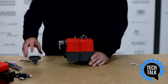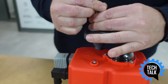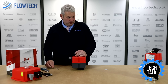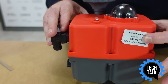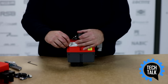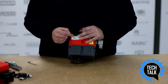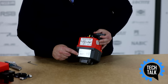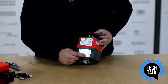The final step is to put on the hand wheel. The serial number can be placed on either side depending which is more visible on site. We can also tick on here whether we configured the actuator to be normally closed or normally open. We have the same at the bottom of the indication label where we can select either the BSR to be normally closed or normally open.